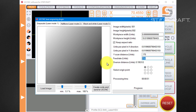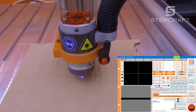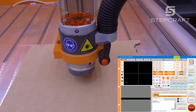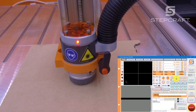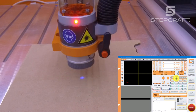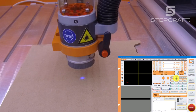The first thing I need to do is adjust my laser. I have it positioned on top of my material. I activate the sensor and press the probe button so it will find the zero height for my material. Now I can set my zero and you can see the pointer. This material is MDF, and we'll see how it works.